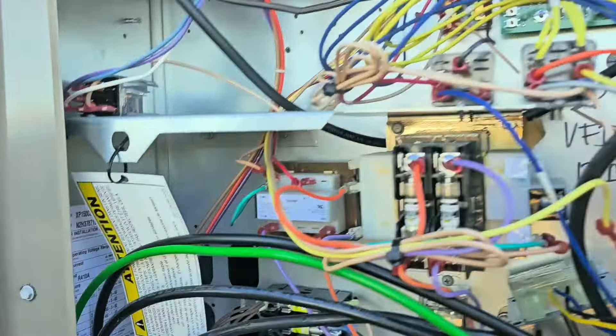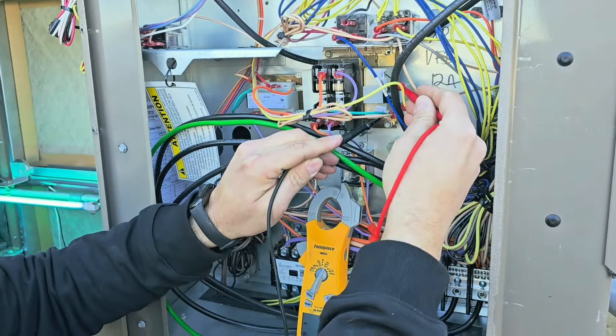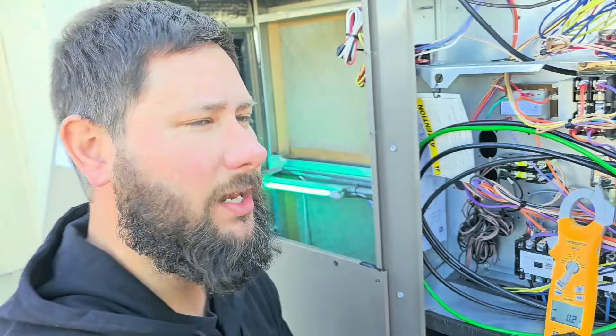The reason I'm telling you this is because you may have a 240 volt unit or it may be a 208 volt unit. You need to make sure you measure the input voltage because you may have to change the tap on the transformer, and that is going to affect your secondary voltage. If you don't have enough secondary voltage, that could cause an issue with your control voltage and your relays being able to energize. So on every commercial unit, whenever you install a new unit, that's something you need to be checking. Now we've switched the tap back to 460, and checking the secondary one more time — 27 volts. We now have the correct secondary voltage to energize those relays.